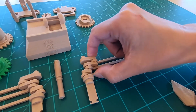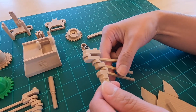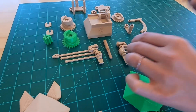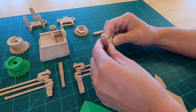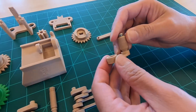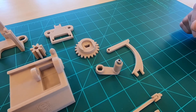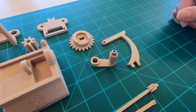There are also little camshafts and these all printed up in one piece too — that's pretty cool. You just have to gently free up the hinges. We did have some issues with the print. This one, I think we didn't have enough infill so the handle wouldn't stay — that's the crank handle. We just stuck a little screw in there. I probably could have printed it at a hundred percent infill, which basically means it's solid PLA, and the handle might have freed up, but it kept breaking on me so I just put a screw there.